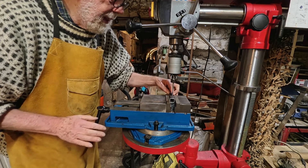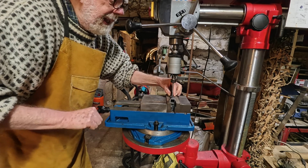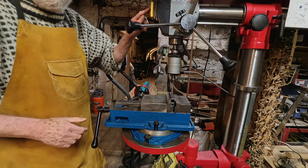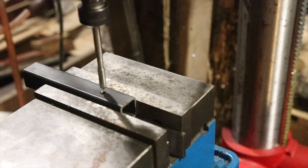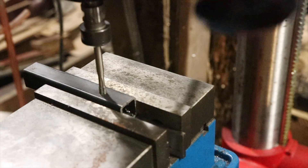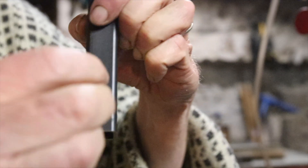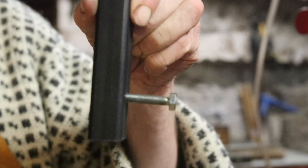Let's see it working. I'm going to line up that pilot hole I drilled with the tapping machine. Switch it on — it's rotating. Bring it down, cutting the tap. Stopping and reversing. Done. And to prove it, there is an M6 bolt in that new tap, totally at right angles.